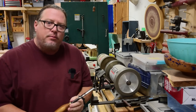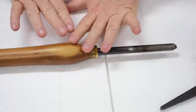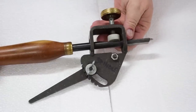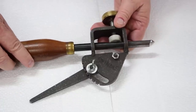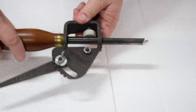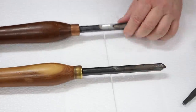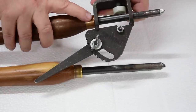So what's my big problem? How far they put the flute on these tools. I am now at end of life on this tool if I use that kind of sharpening system, because I can no longer slide the sharpening gauge and register against some kind of flat. This pad needs to register against something so I can consistently come back in. Once I get past here I start coming up on the rounded section and it's just not consistent — you don't get an even grind. So I need to extend that flat down, just like I've done on this other tool. But this tool has reached its end of life even with that modification because I'm now hitting the ferrule on that one.